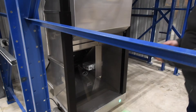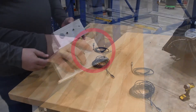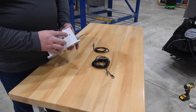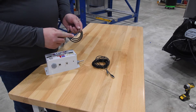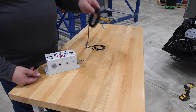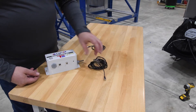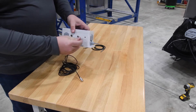The QFM control box, located on the inside right panel of the QFM plenum, contains a 3.5mm jack, which is built for use with our auxiliary test probes. We provide you with the digital probes. You will notice that one end is a plug and the other end is a temperature sensor. It is at the very tip of the probe which the temperature is sensed. We also provide 3.5mm jack extension cords. The way that we recommend using the extension cord is to insert the extension cord into the 3.5mm jack, which is on the bottom side of the control box.